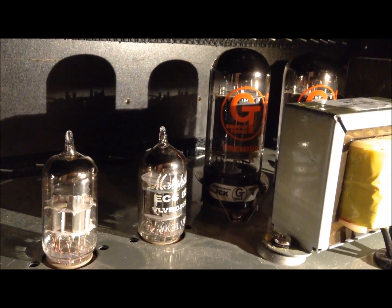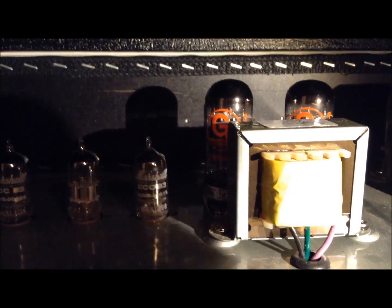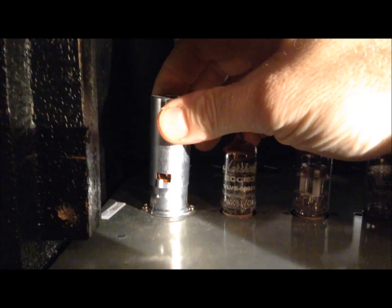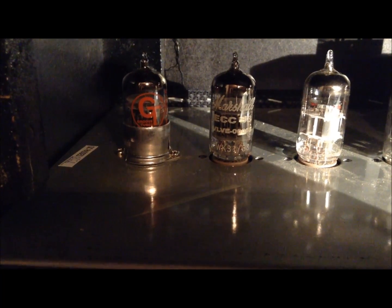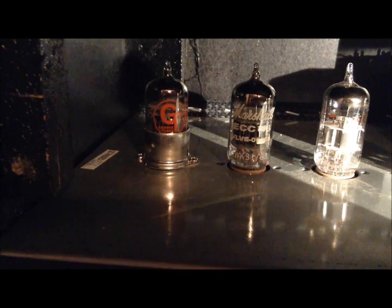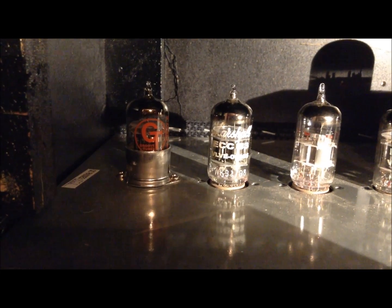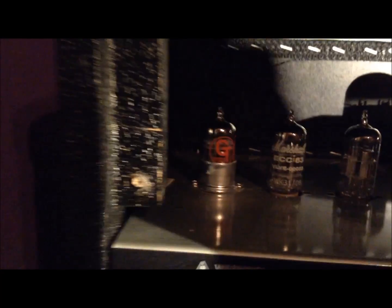The old ones are about 1.5 years old. Probably 150 hours on them, maybe not quite, but around there. So fine, I went down, and then I thought it'd for sure be the first valve in line here. So I put a new GT valve in there too. Those are ECC83s, or here in North America they're the 12AX7s, and that didn't change anything. So I actually swapped that. I originally had it in this position. I swapped it out to that position, and no change there.